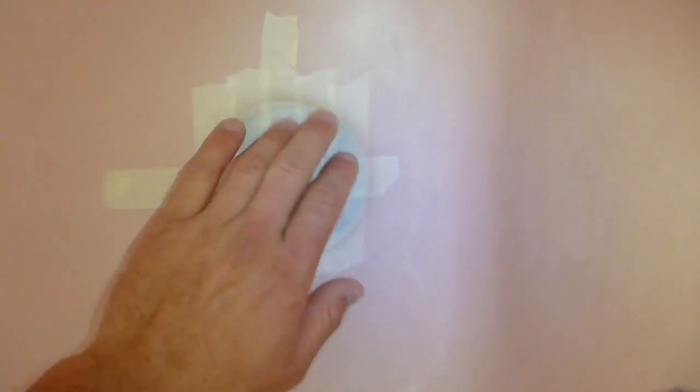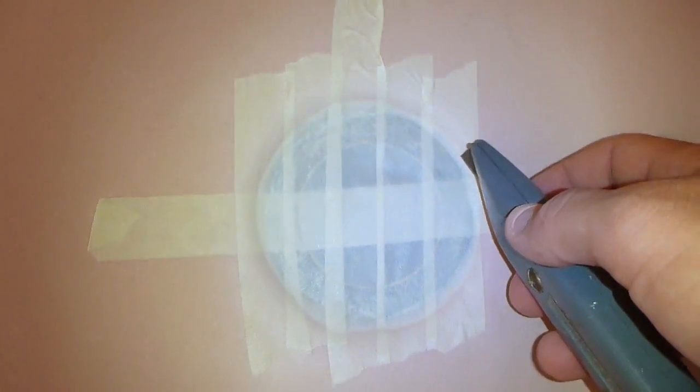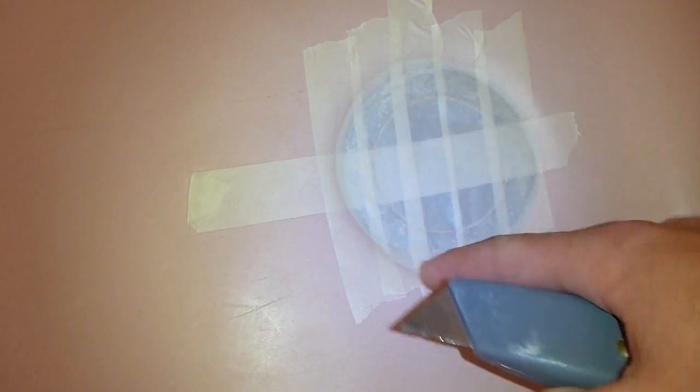Now with this drain pipe, obviously I don't want that to be painted. I've used some simple masking tape and I'm going to get a Stanley knife and cut around it to get a perfect circle. So I'll be able to paint the edges of the bathtub around there but I won't get the chrome drain, and then I'll give a final wipe over to collect all the dust.